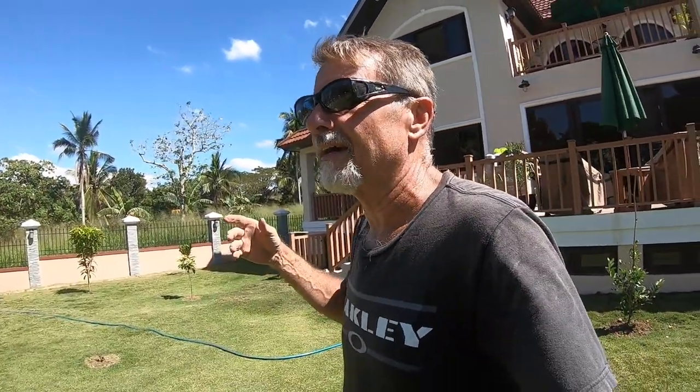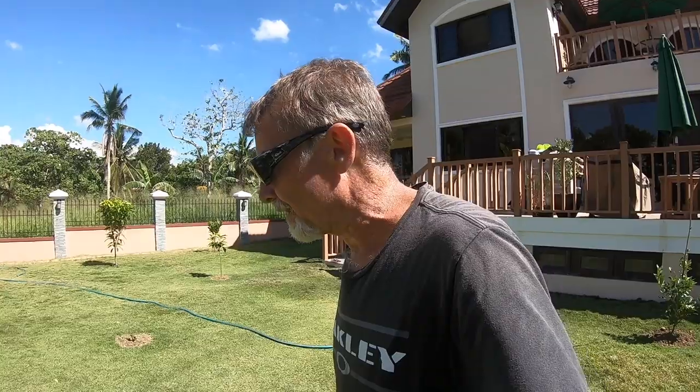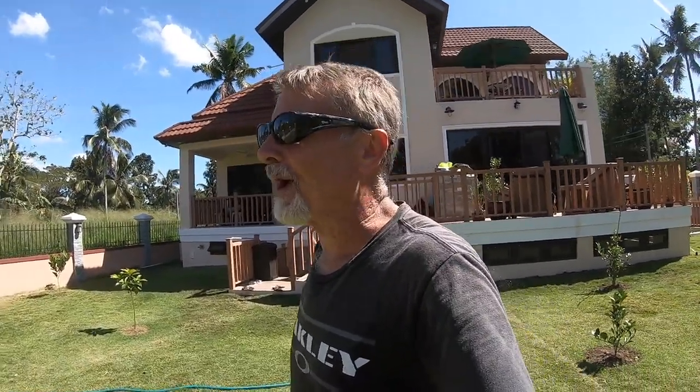Okay, well, it looks like it's working well. I don't have quite the pressure, and I didn't expect to get quite the pressure that I would have with the water coming directly from the cistern below. Because remember, we have lots of line loss. We're running in on a half inch pipe feeding a 3/4 inch pipe for the runs going all the way to the sprinkler head system here.